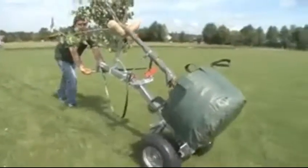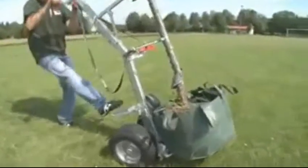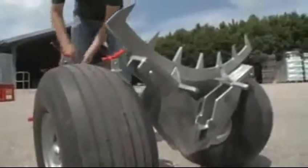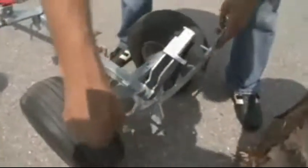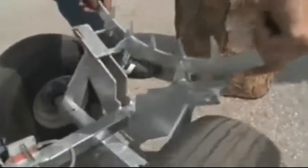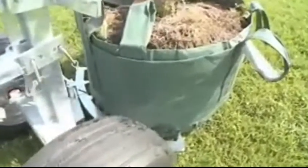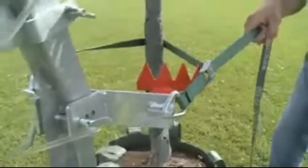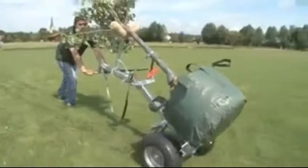Another accessory is the cutting tool. To fix the cutting tool, it is simply inserted into the two guide rails from the top and fastened with pins and spring bolts. Alternatively, the cutting tool may also be mounted reversed from the bottom. In this case, the objects to be transported can be penetrated further down. Then the tension belt must be fastened again at the seam gripper for safety purposes.